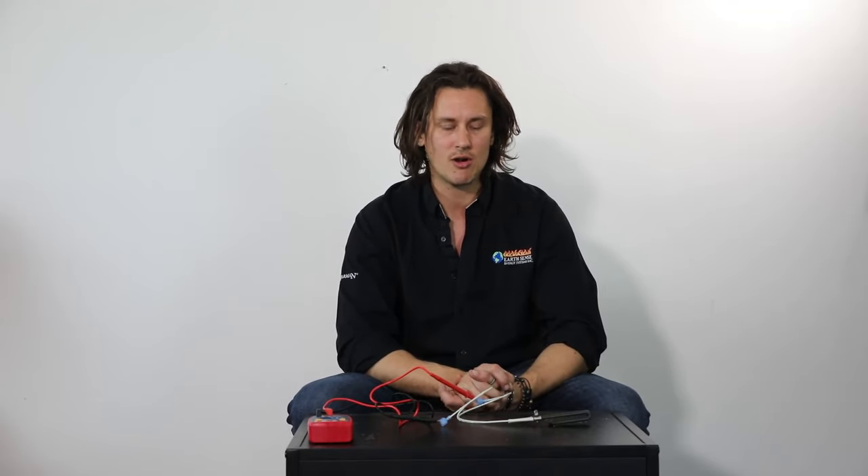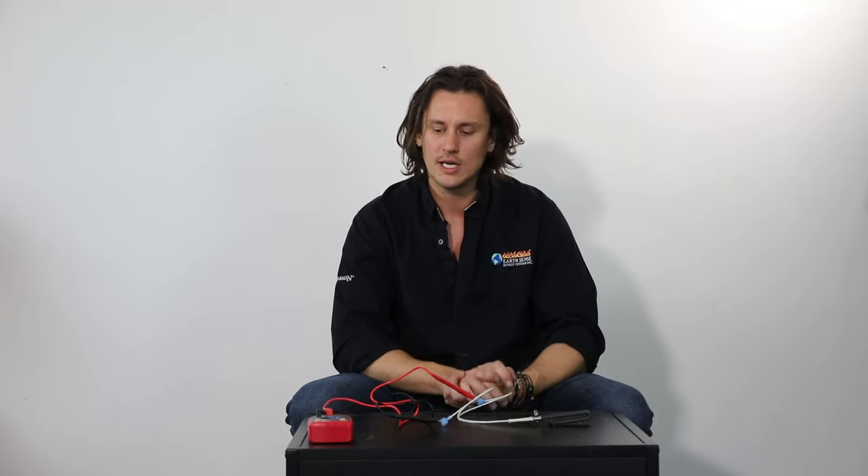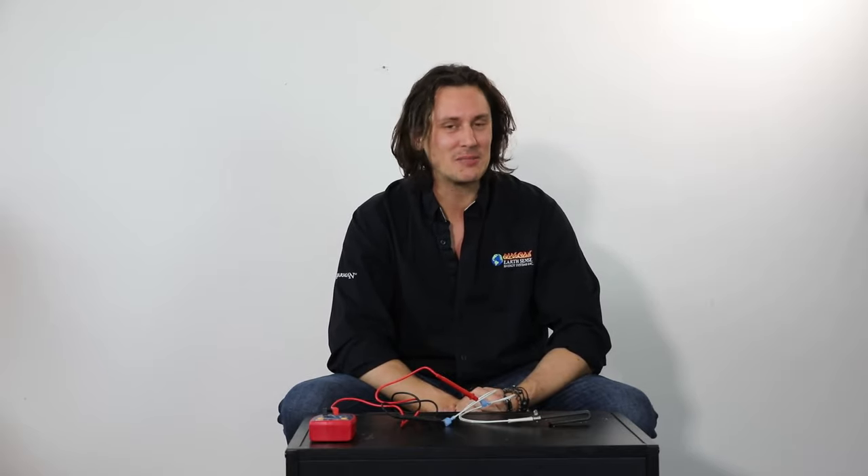I always tell people to start with the basics first. Ninety percent of all the issues we ever see with a pellet, corn, or coal stove generally have to do with cleaning and maintenance. So make sure the unit is clean, gaskets are tight, and check all the basics first. If you're still having issues with ignition, grab a multimeter and see whether or not the igniter is in proper ohm range. That can help you get back to being warmer quicker — and that's what we all want. Any specific questions regarding igniters, your particular stove, or anything else, just leave a comment below. Always happy to help. Thanks for joining us for another session of Pellet Tech 101 — we'll see you soon.